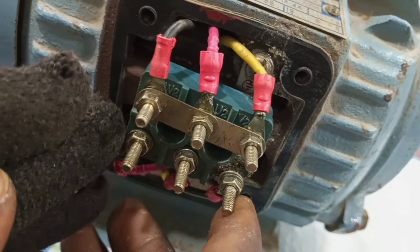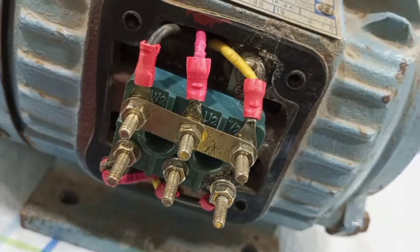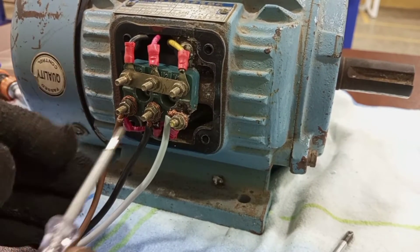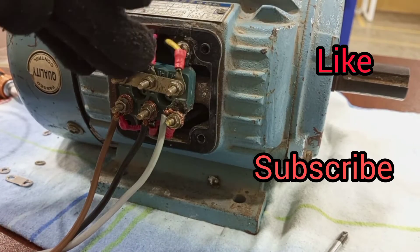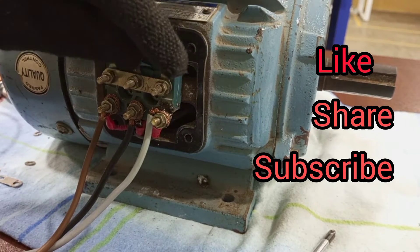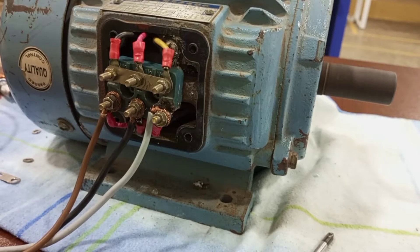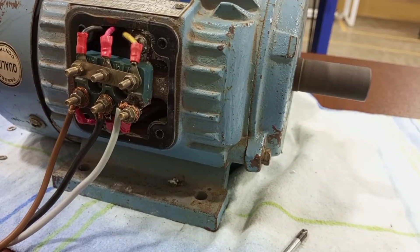For the sake of clarity, I'm going to connect it to the supply so you can see the motor working on the star connection. So this is our supply connected to the motor — we have line one, line two, line three — and the ends of the three windings are connected together. This is star connection. With our motor connected in star, we switch the supply on.